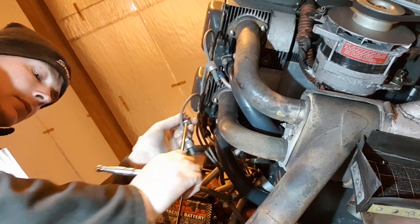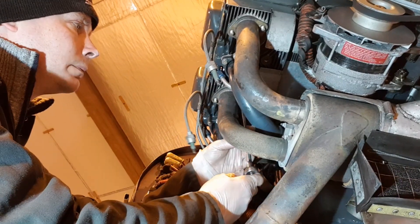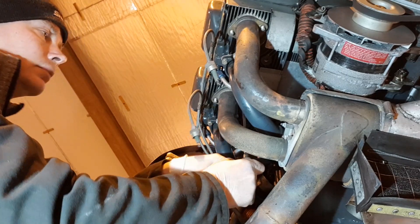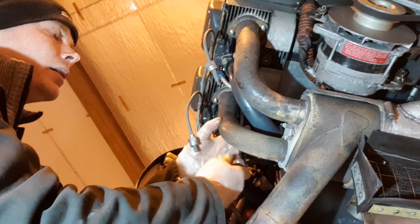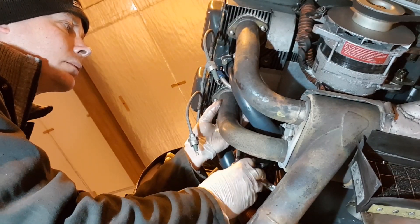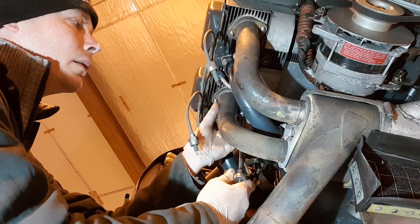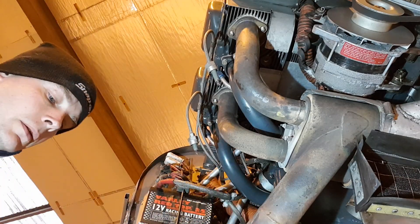Just being careful to catch the washers there as well. Keeping an eye out at the exhaust flanges too — we don't want to see any blow-by on there either, because that will erode the cylinder flange, which would mean you'd have to take the exhaust studs out and redress that flange.